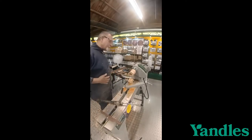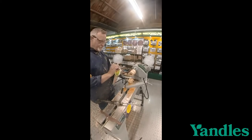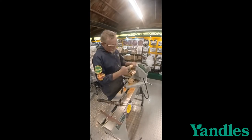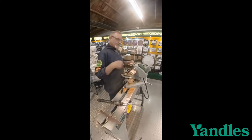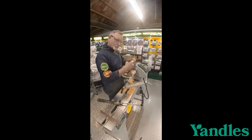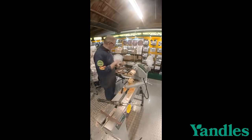Okay, let's just show you something. These are some of my favourite things to have in the workshop. They're bamboo skewers for making barbecues, kebabs. When I'm teaching, they form an absolutely excellent spindle. Okay, so if I poke my finger in there and make a cup shape, people say when you cut, you cut downhill, you cut into the wood. It's not always true. I'm going to go in and I'm going to pull out and get a smoother cut. The reason being, there I've got a grain supported cut. So I'm coming from a shorter grain to a longer grain as I come out. If I try to cut inwards, I'm jagging all the way in as I catch the fibres, yeah? So I'm going to put a grain supported cut by going in and coming out. Sorry, putting the tool in and cutting on the way out.